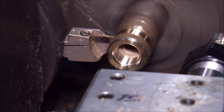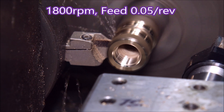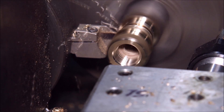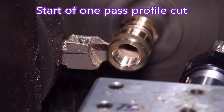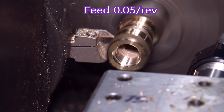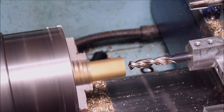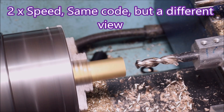Between the up and down movement you can actually see it go blurred slightly. This is because there's backlash in the turret. The turret uses a worm and wheel — the wheel is split in two halves, supposedly to make it possible to adjust out any backlash. But unless it's perfectly done, the backlash is more in one place around the circumference of the wheel than another, so you end up with a tight spot. If it's too tight the motor will stall, and by the time you've backed it off enough to be nice all the way around the circumference of the wheel, you've got this backlash that you can see here. When you do a lot of hex work, as my parts have been in the past, it just makes a terrible noise, vibrates, and doesn't really do a good job.